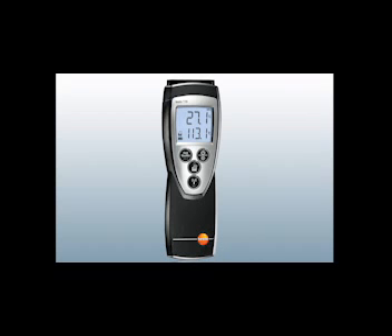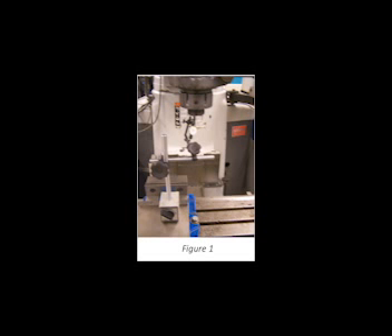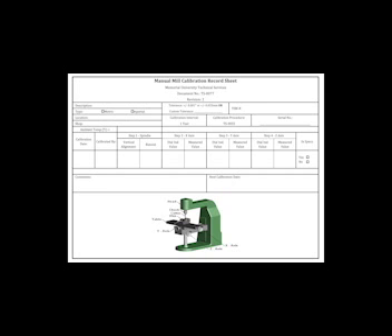Start by measuring the ambient temperature and recording it. If the temperature is less than 18 degrees Celsius or greater than 24 degrees Celsius, see the division manager for further instructions, as that is outside the acceptable range. The second step is the test characteristic: spindle runout and vertical alignment. Remove the tool or chuck from the machine — it will be held by pressure or a large retaining nut. Securely mount the magnetic base on the table and place the finger dial indicator in the inner bore of the spindle. Place the machine in neutral and rotate the spindle 360 degrees, recording the maximum dial deflection. Also run the dial indicator along the vertical portion of the spindle. Always record all of this on your manual mill calibration record sheet.